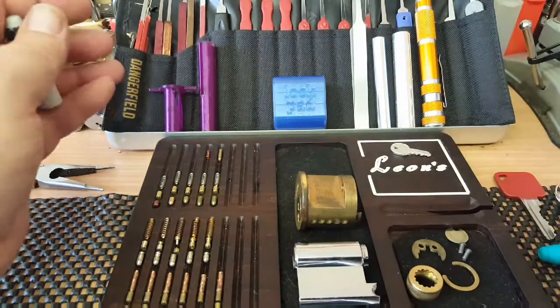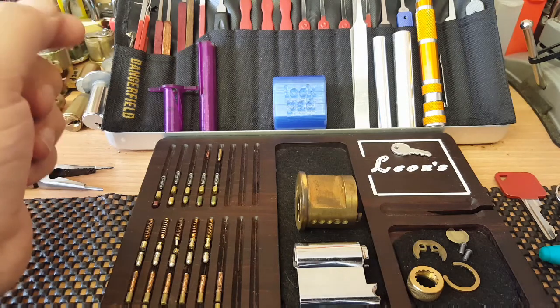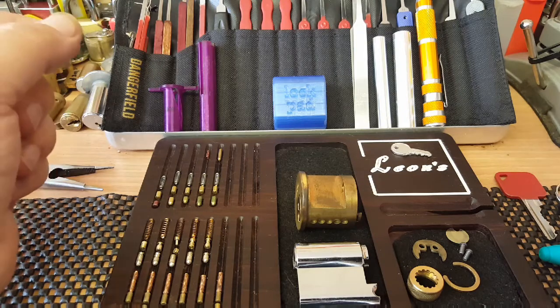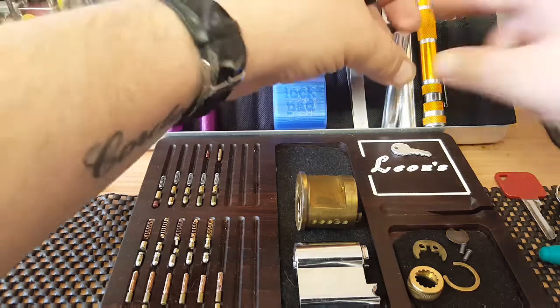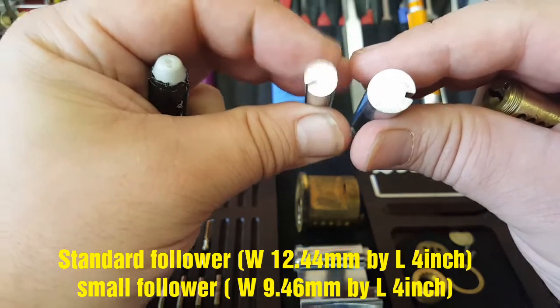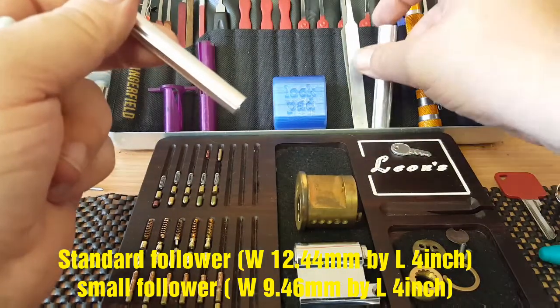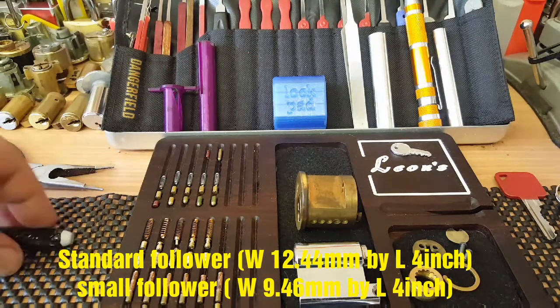And the follower you want, the width would be 12.44 millimeters wide. I won't go no more than 4 inches in length. The small follower is 9.46 millimeters, and I won't go no more than 4 inches in length. Like I said, I'll put all those numbers in the description, and the small follower will do for another video at some point. I'll show you. There we go. That's your big follower, that's your small follower. This is mainly for your American series locks and stuff like that, padlocks. This is for all your normal standard locks. But yes, right, I will stop waffling and we'll get on with it.